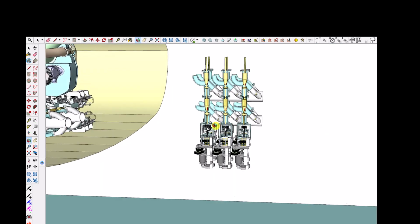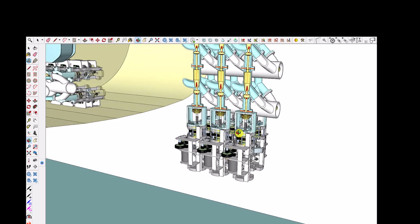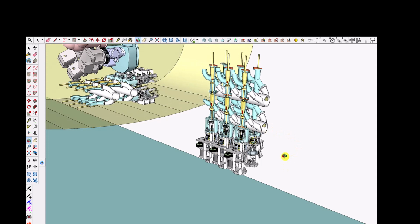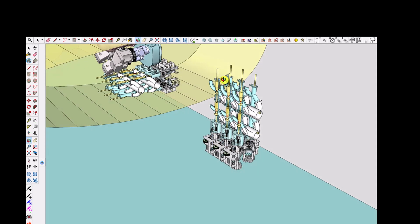And here is a cutaway view of that manifold. I think it's going to be critical that you control these valves very precisely. That's what's going to allow you to have a stable hover. In this design, one of these pipes is the main pressurized flow, and the other pipe is the main return flow. So these two pipes are going to the pump system, and these 6 output pipes are going to the 6 different propellers. So there's 6 output pipes, and there's 6 return pipes.